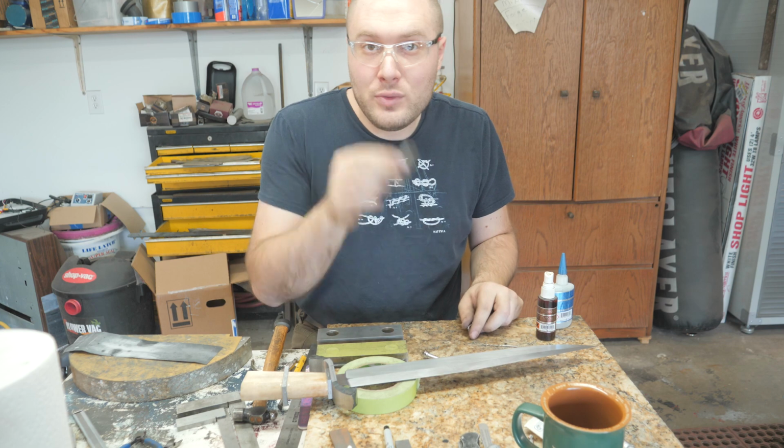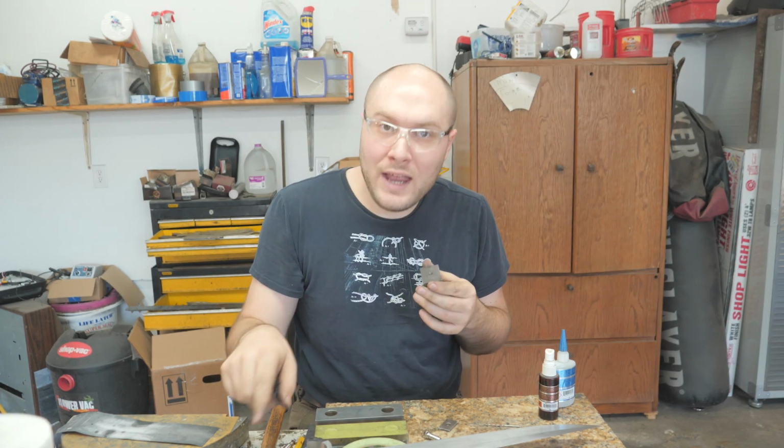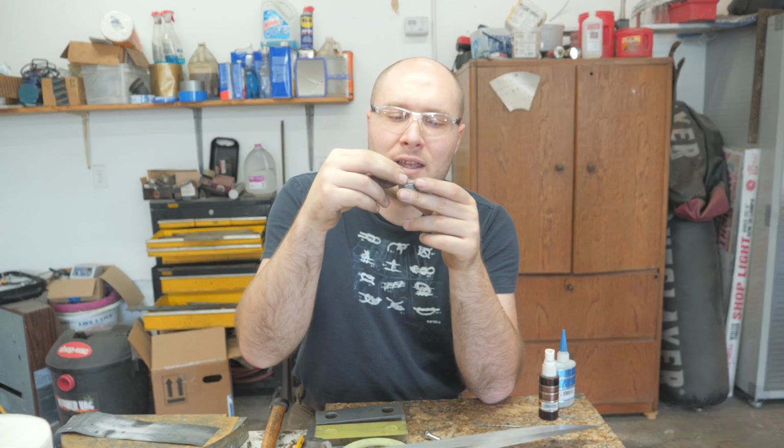So there's gonna be an issue with the pommel. With the spacers, I could just drill holes all the way through because you're not gonna see the end of it, but with the pommel, you can't just drill your holes all the way through. So, to get the lineup holes to match on the pommel and on the handle material, you have to use some kind of in-between metal spacer like this. This is a spacer that I've got some little holes drilled on the sides and then a big hole for the pommel nut.